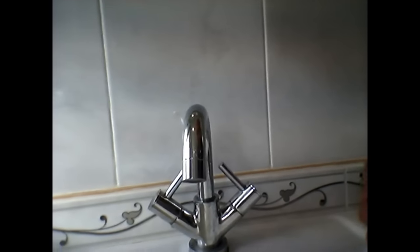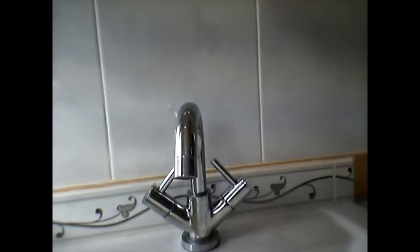So what we're going to do — there are a couple of options. You may find when you look up underneath the basin that there's a big nut. If you've got a big nut, the answer is fairly simple, and you're going to need one of these to tighten it up with. This is called a basin spanner. If you've got single hole taps that go through, they'll have a nut on the bottom. I have got a video on how to tighten those up and how to do them — it's on my channel.